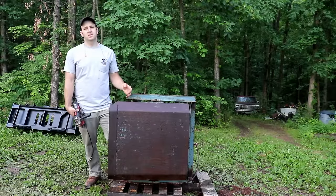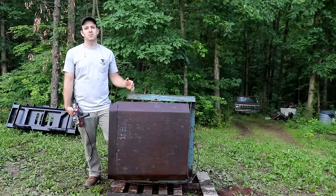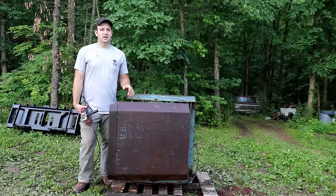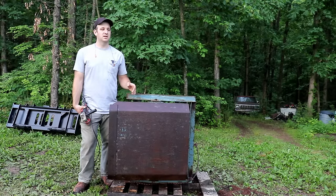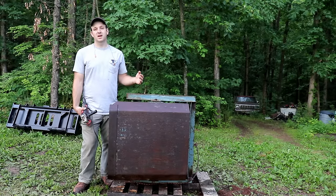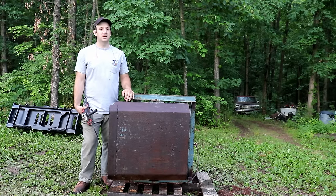When I started out using this pressure washer sandblaster, I was disappointed. I guess that's because the first one of these I saw was for use with a recommended 4,000 PSI pressure washer. It was one that Northern Tool sells. And it would strip the metal down to bare metal, cleaner than a new piece of metal. And it was also faster than this one, which, that little pressure washer I think is 2.3 GPM. A 4,000 PSI pressure washer may be 4 GPM. So that's why it would be a lot faster. It'd be twice as fast, I guess.